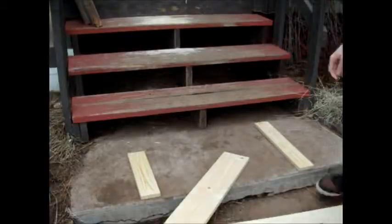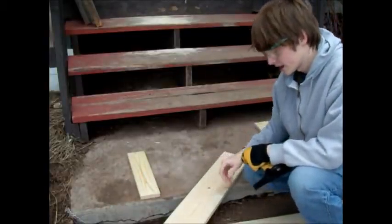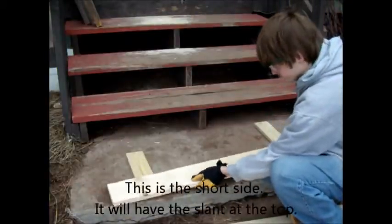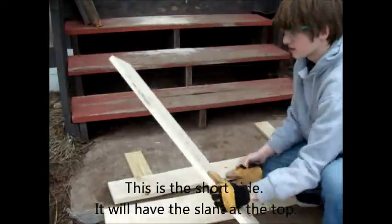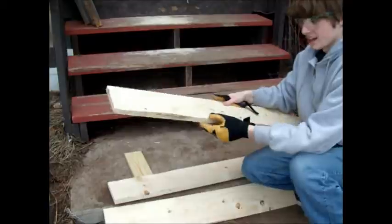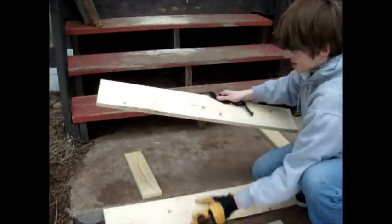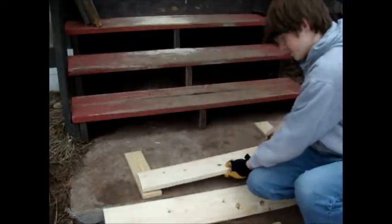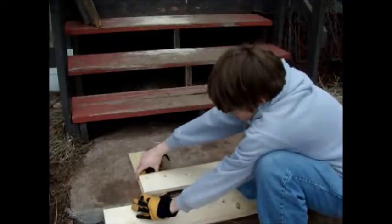So I'm using these 2 4-inch boards as my vertical posts, and now I'm going to take 3 of the 5-inch boards and find one that has an ugly side to it and choose that one as the bottom. This one I think looks the worst, so I'll put that facing inside on the bottom and line it up with these posts on the edges.